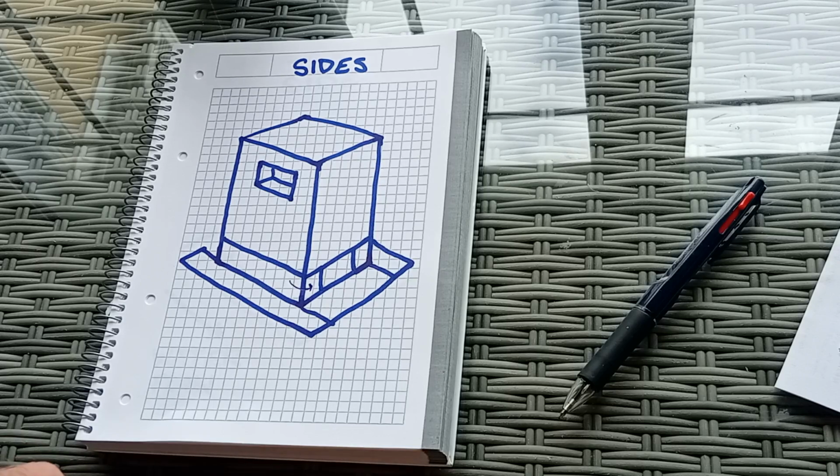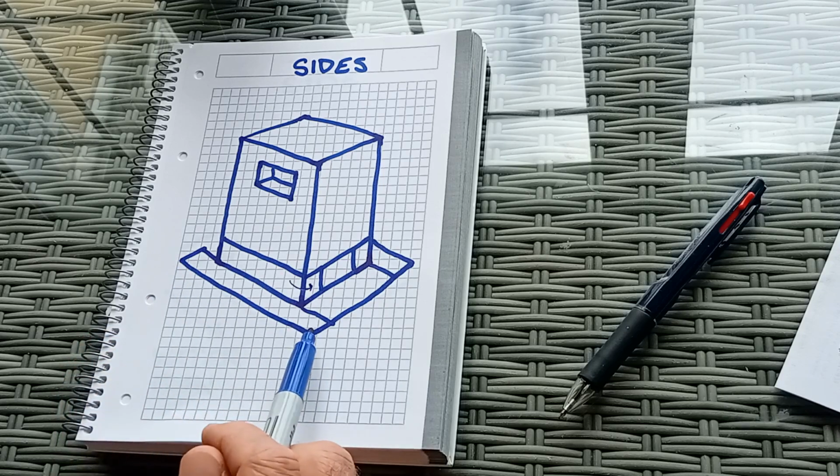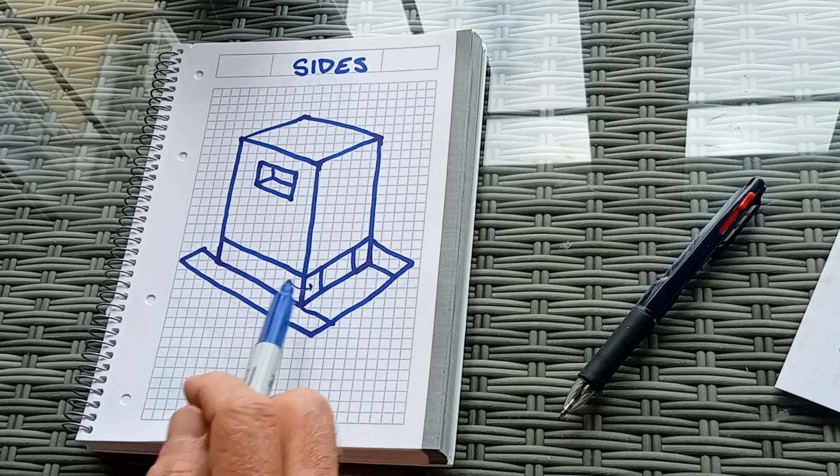The next two strips will do the same thing, but on each side of the chimney. The 10 to 12 centimeter excess will overlap the bottom flashing on the wall and the deck. So it looks something like this. Coming across, it goes over the deck part and then wraps around over the wall part.